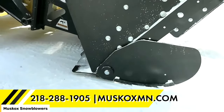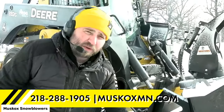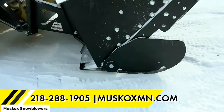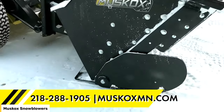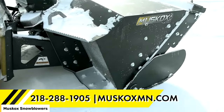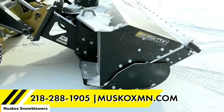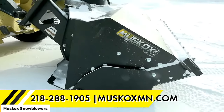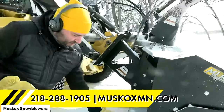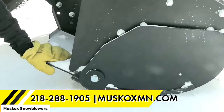Watch Ron in the forward position so you can see how we ride on the glide plate. On that 585 square inches, you can see a little bit of white on the bottom — we have UHMW plastic we're riding on, so we're not scratching the surface on any type of concrete. Now Ron's rotating the machine, and now we're getting onto our steel cutting edge — this is important to watch. The glide plate was on the ground before; now it's rotated up in the air about 4 to 6 inches, and now we're riding on a steel cutting edge.